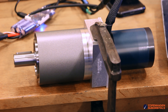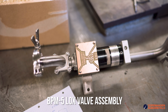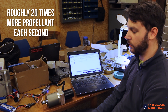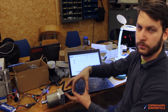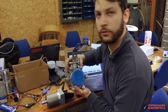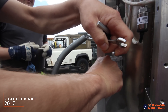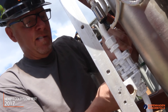But Adam, what has been the challenge in making this kind of valve instead of the one we made on the BPM-5 engine? Well, the BPM-100 engine is a bit bigger than the BPM-5, so that means it will chew up more fuel per second, more oxidizer per second. So that means we need a bigger valve. The BPM-5 valves, if I recall, were like this big with the valve body and everything, and the BPM-100 valves are like this. So we need a bit more oomph to open them up. This is why we need to upgrade in size if we want to achieve the torque levels required to break that open when it's cooled down by the liquid oxygen.